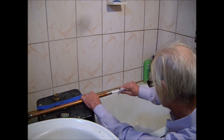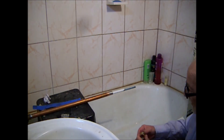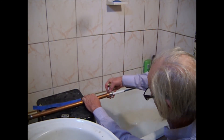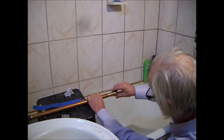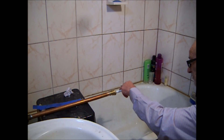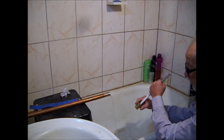Now we dry this part so it doesn't wet the fitting. We must be quite fast because we don't know how well this will hold as pressure is growing. So we prepare the fitting beforehand — dry the pipe, the part to solder, sand it, put flux, slide the fitting in, and solder. Once finished, now is when we really get wet, because we have all the pressure there and it will be released in our face. Here it comes — yeah! It wasn't that bad, but as you could see, it worked.